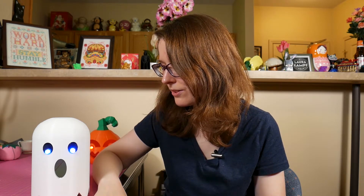I printed this in MatterHackers Build Series PLA in white, of course, and it was my first time printing with it — a fresh roll, just got it. My original white spool from Monoprice had finally run its course. I have to say I'm not 100% thrilled with how it printed at default settings. I've used Build Series PLA before, just used default PLA settings in PrusaSlicer — it's been fine. This wasn't that fine. I didn't like the finish with the supports, and I used the detachable support settings. I don't usually get this kind of finish on the top; I can see a lot of lines, so I might have to play with that.